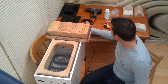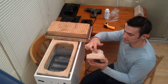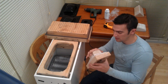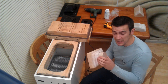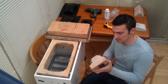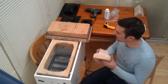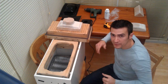I've also made another unit which has the fan mounted inside with some ducting to the outside, making it a much nicer final product. You really need to create some draft on your molds — if you don't have any draft it's incredibly hard to remove the mold from the finished sheet afterwards. The more draft you can have the better; I read that you should have a minimum of three degrees. You could also use compressed air to blow the plastic off the mold, which is what they do in commercial vacuum forming.